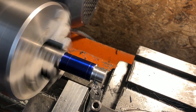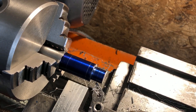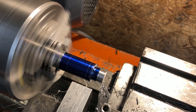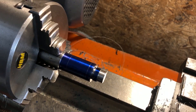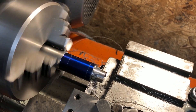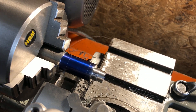With that set I can then proceed to reduce the shoulder to half inch for threading. The plans call for a reduced section at the end so I'm marking this out and again setting the length with the carriage stop before turning to the specified 7/16ths. With that to size I can create the runoff groove and set up for the half inch 32 thread. A quick clean up and a check for dimension and I can turn my attention to the diameter on the other side of the shoulder.